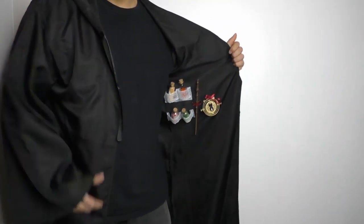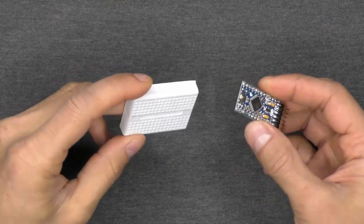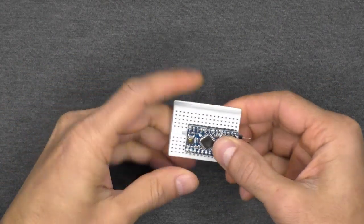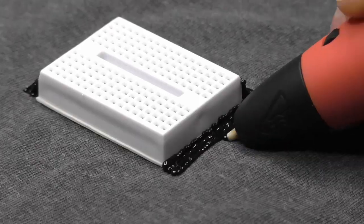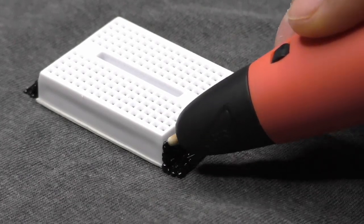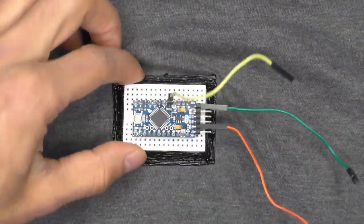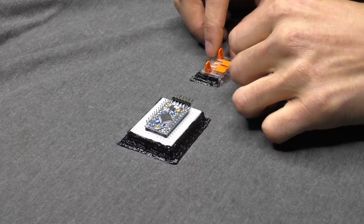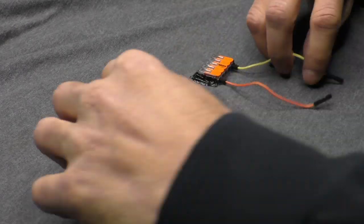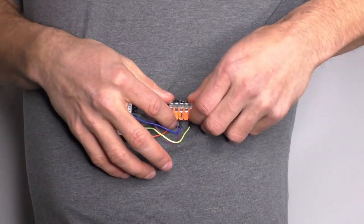I hope you're seeing the power and flexibility of these techniques. Let's now talk about how this makes incorporating electronics into your cosplay and costumes so incredibly simple. There are a couple of aspects for this that I'll touch on with regards to 3D pens. The first is just mounting Arduinos, control electronics, and batteries very easily and in a secure manner. One challenge with mounting electronics is needing to take them on and off for programming or rework, as well as having access to the wires. By using a 3D pen to fix a solderless breadboard in place, that solves a lot of these issues. You could also do this for a custom designed PCB. Another fun idea I had was incorporating WAGO lever nuts into the fabric to create built-in power distribution areas. I think using a 3D pen with these type of electronics can open up a whole new area, and I can't wait to show other ideas in future videos.